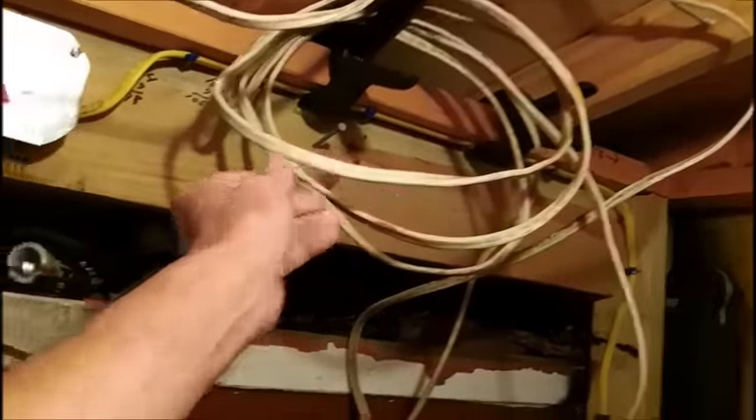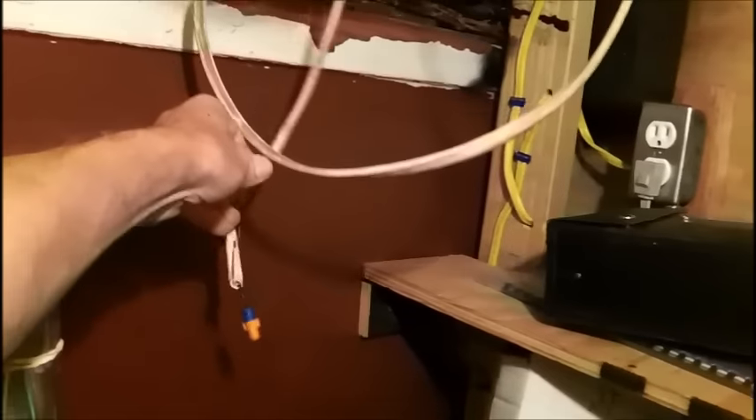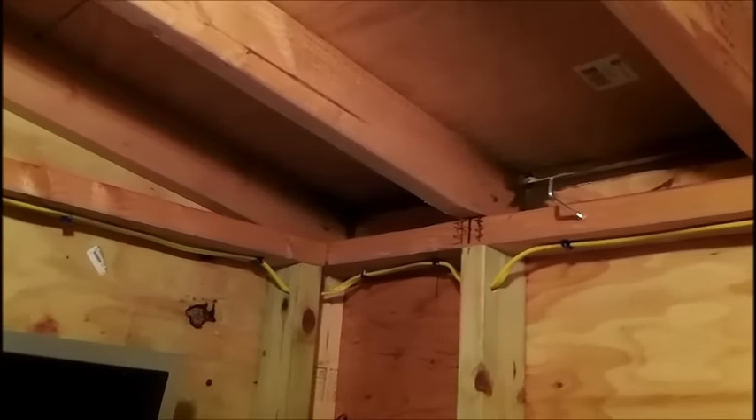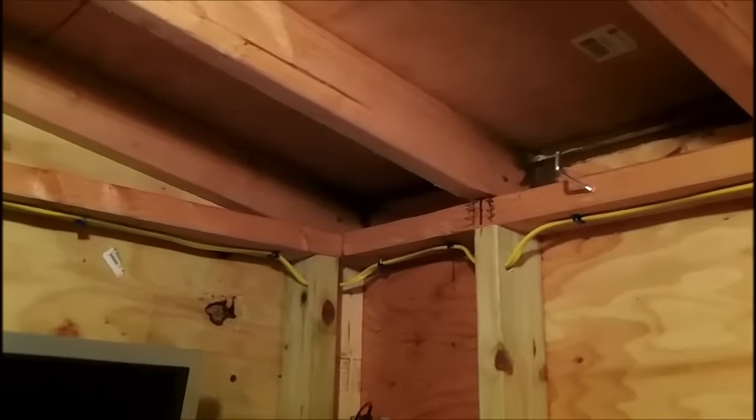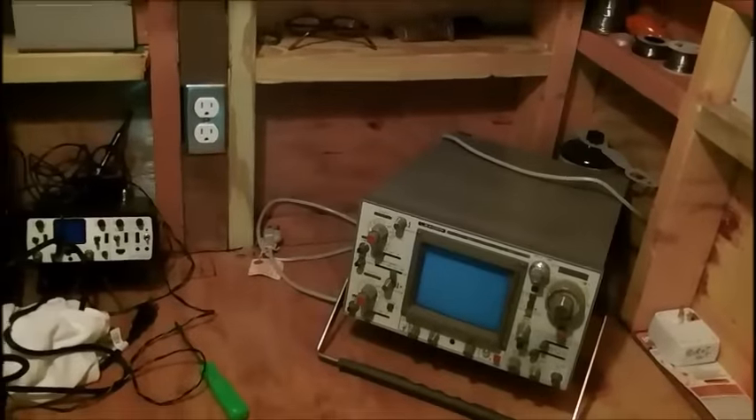The shelf is not going to be at this point because I need to work here. Halfway down, this toolbox is going to have to go to the wall, which means it's going to be a longer workbench probably. What I've got to do now is run the 14-gauge wire for the lighting. I've already got 12-gauge coming in for the circuit and I'm just using 14 to come out - this is live so I capped it off. There'll be a junction box up here and my four-foot fluorescent - actually I was going to put a fluorescent but instead I bought an LED light.